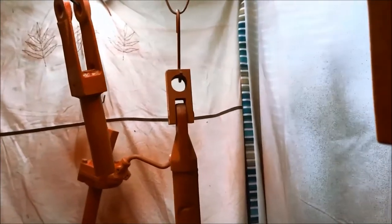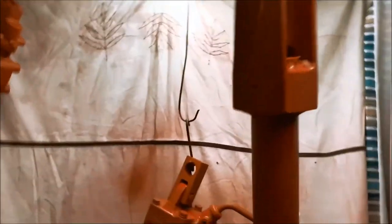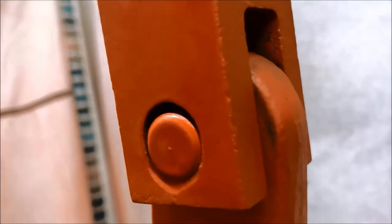We'll give it 10 minutes and then come back and give it another quick spray over the top, give it another 10-15 minutes. In the meantime we'll be mixing up the chocolate brown paint. When you're painting indoors with one light at the top, take all your bits outside and have a look at them to check for bits you've missed. You can see here on the back there's a bit I missed, and on the handle here there's a little bit - we'll correct that before we go on.